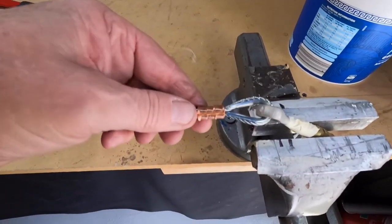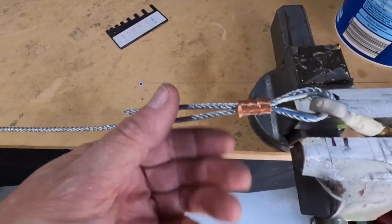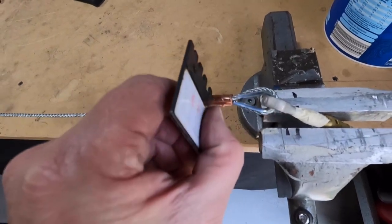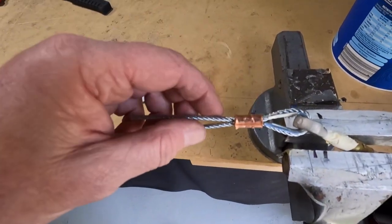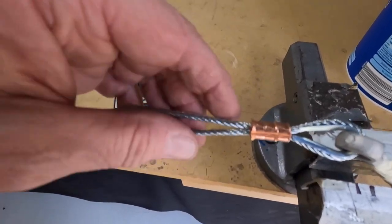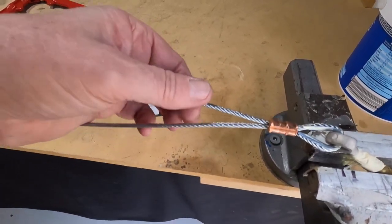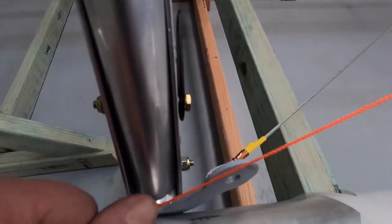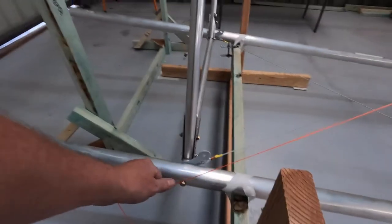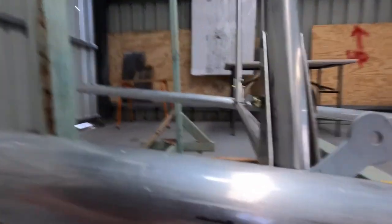Starting to get them up at arms and I've crimped that down. I leave a quarter of an inch gap and then this sort of swells up. You don't go too close because it jackknifes and it looks crap and probably won't pass. My no-go gauge slips onto each one nicely, and you can see I've got three distinct bites — that's what I sort of aim for. In the book also, if you want to be proper about it: middle, then up at the throat, then down at the skirt. So one, two, three. This tag will come off later.